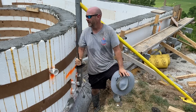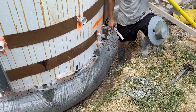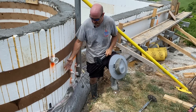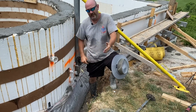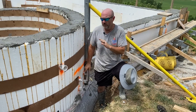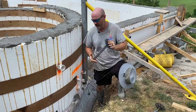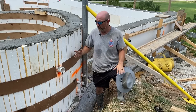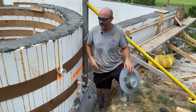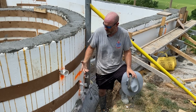We got it done. Just wanted to show you up close — you see the fast foot bag. If you ever see a lot of the monopores you know I did the video, I'll link it right here — it's purely a fast foot video. What we do on the pool is attach it to the outside so it holds the concrete back; the inside allows it to flow in. If you get it too wet it's just going to all flow in, but we get the mix just right — about a four slump, real pumpable mix — and it'll stack up in the wall. Everything is about the fast foot fabric and these legs. There are guys out there doing plaster-style ICF pools in multiple pours. I like to do it without cold joints. Everybody says this is an awesome way of doing it — it's harder, but we're pretty decent at it.